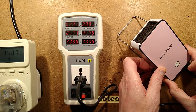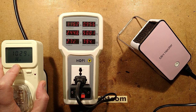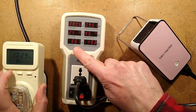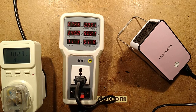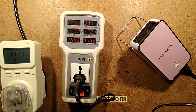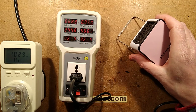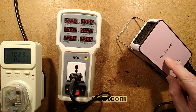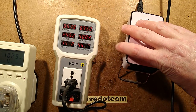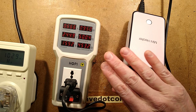Plugging it in — going to have to push that button. It peaked at 1000 watts — 1 kilowatt — when it was in its cold state. What is it currently running at? The power is gradually creeping down as it warms up, because it has one of those PTC heat elements. 0.7 amps — they said 0.6. The power factor is 0.95 — that's because it's mainly a resistive heat element. It's settled down to about 160 watts.